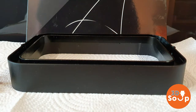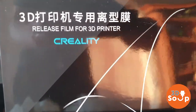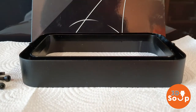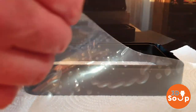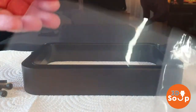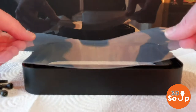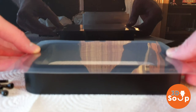With that cleaned, we are now going to replace the film. This is Creality's own film for 3D printers - of course you can get it from other companies as well, but I'm using the Creality one because it's the one I got spare with my printer. Take the film and remove the protective covering from it - much like a mobile phone screen protector. You want to make sure you don't get any dust or particulates on it, because any of that can cause a print fail.